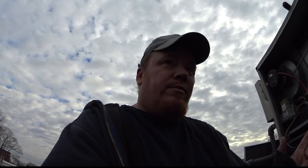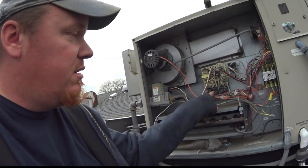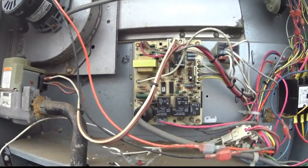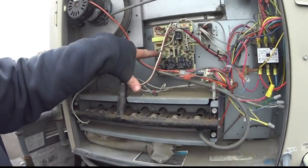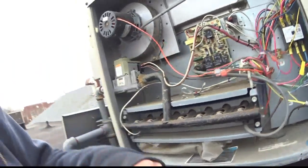It got here this morning to put it in, and it's still the same issue. What I did find — and I'll show you when I pull it off — is this board down in the back. On the backside of the board, the way everything goes from the flame sensor, it looks like there's kind of a short between two of the wire strips on the back of the board. So I went to Lennox, got a new board, and I hope that's going to do it.